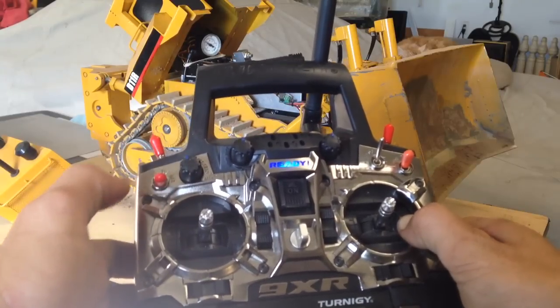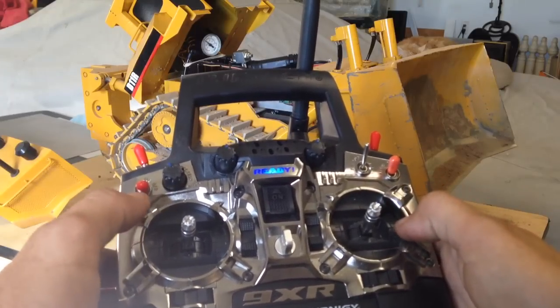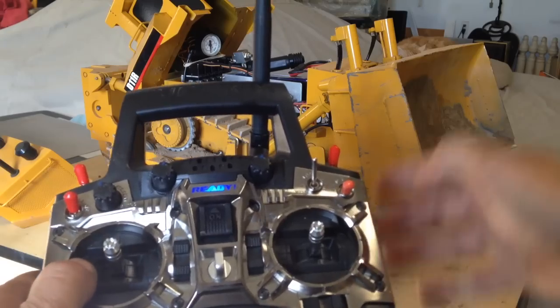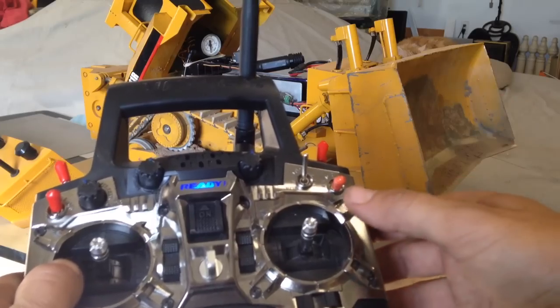This is for my pump — that kicks it up to about 30%, and then when I give it stick input it kicks up to 100%. This one here is to toggle back and forth between my tilt cylinders for the left and right to work together or opposing each other in order to get my tilt left and right.